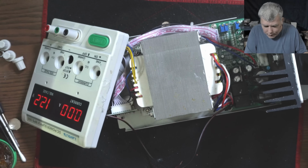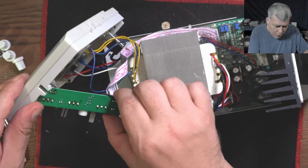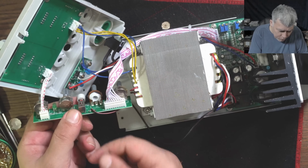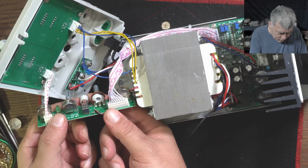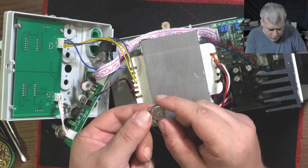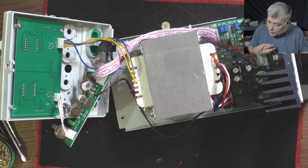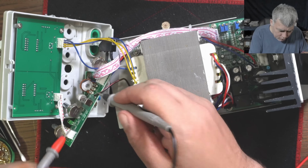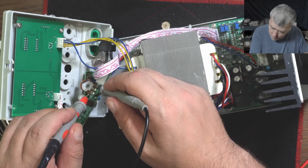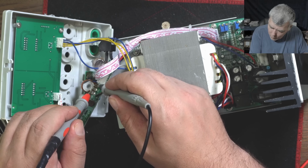Okay, if it's working, it's okay. Not sure for how long it will work. Not sure if I should put back the black metal. What's the size of this potentiometer? It's not saying. Let's check with the multimeter, just to know, if it's getting broken, to buy another one. Two kilo ohms.